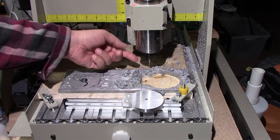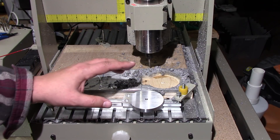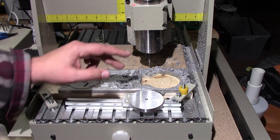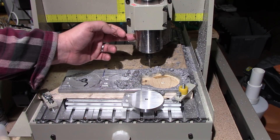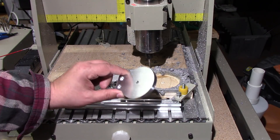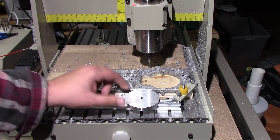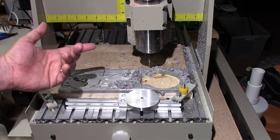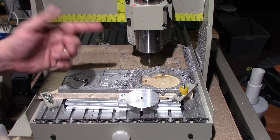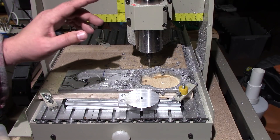Now, technically you could say if I pull it up and everything it's about the same, but you can really tell in the sound of the machine as it starts getting to the bottom of this, because there is some flexure in this machine. It's definitely not perfect. And again, when it comes into some of these curves and everything, it really takes a little bit of a load. But hey, for under $1,000, this thing has been crazy good. So if you're looking to get into CNCing, I really recommend this, and you can do quite a bit.